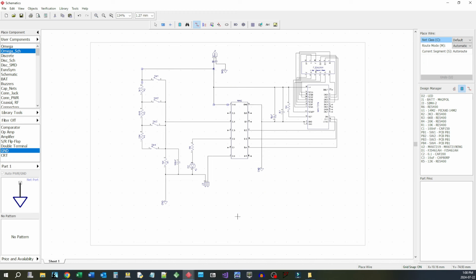That's it. That's our completed schematic. So we have our two modules all connected up to appropriate I/O on the PICAXE, and we have added in a way to get some notifications so we can hook up a piezo speaker here, and we have an LED that we can flash as well, and we have a way to connect up the power up here.